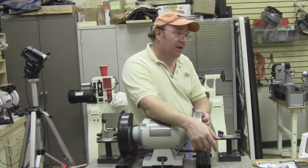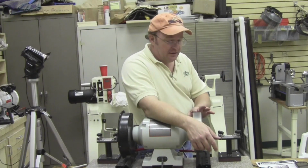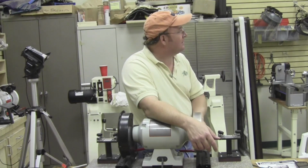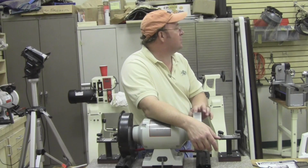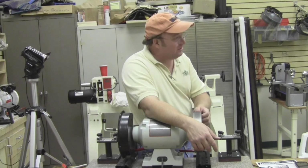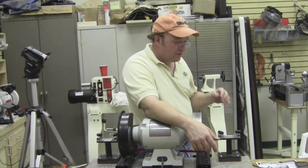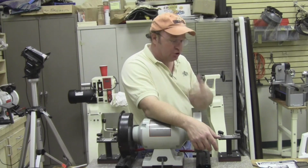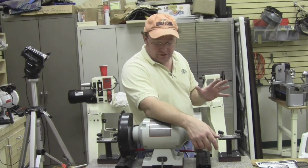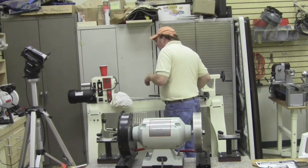They weigh a lot. They're like a 6 or an 8 pound wheel because they're a solid chunk of metal. But if I do recall, I was talking, Dave, I think these are a nickel bond is how the CBN is attached to this. And it's pretty close to a lifetime wheel. You know, you're looking probably 8-10 years anyway. So they're pretty neat. But they're nice because they turn so true. You get no bounce on the wheel. You can clean them up real quickly. They're really nice for that. And they never change dimension. No, and they never change dimension.